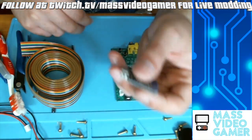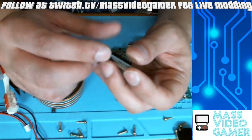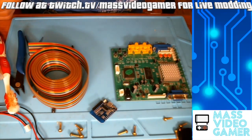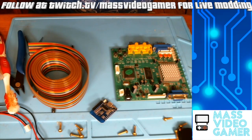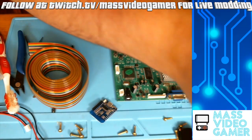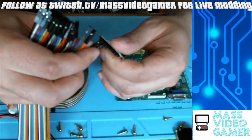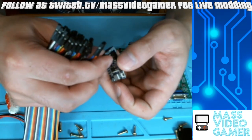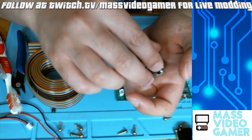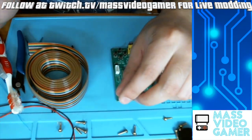There are two ways you can attach it to the GBS 8200. You can solder in headers — some ESP8266 boards have them already soldered in — and then use DuPont connectors. DuPont connectors have female ends; in this case you'd want a female end DuPont connector to connect onto your Arduino board and solder the bare lead onto the points on the actual board. However, today's installation is not going to use headers or DuPont wires — I'm going to be soldering directly to the board, because I'm really only going to use this one board for this GBS 8200.